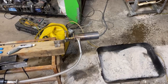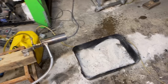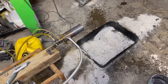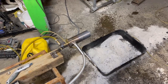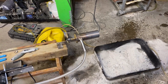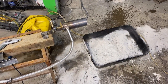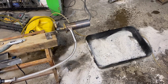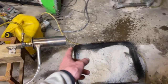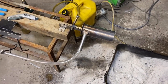It'll just get all gunky. I've cut one of those coils open before and examined it, and I have a video where I use the vaporization coil technique — and that's only good for things like propane. It's not good for some of these liquid fuels; there's just a lot of carbon in them. I think we're just going to try and do another test with the combustion chamber a little bit longer. I'm just going to tack weld an extension on this and we'll have a look and see what it can do.